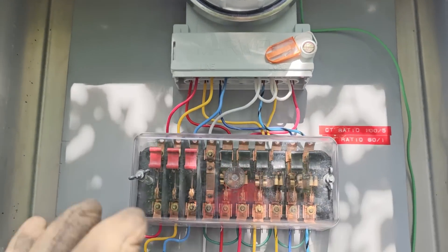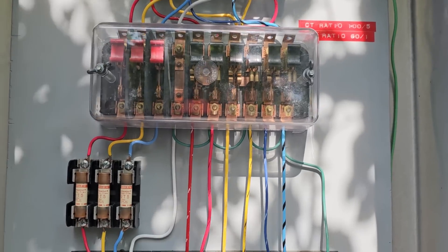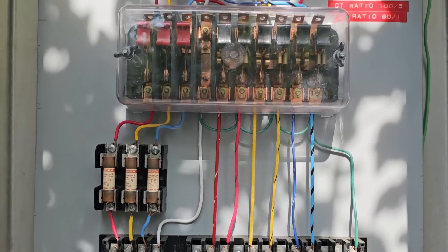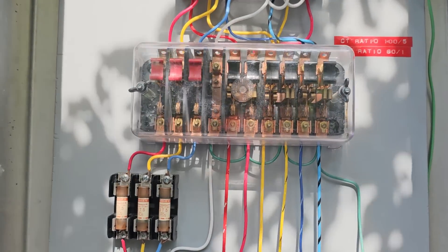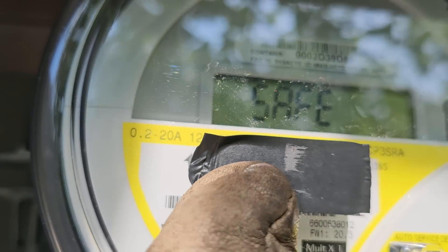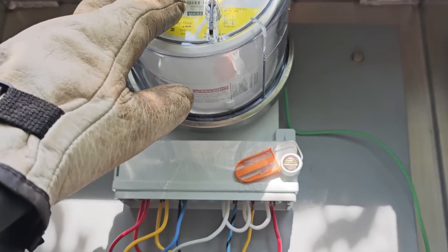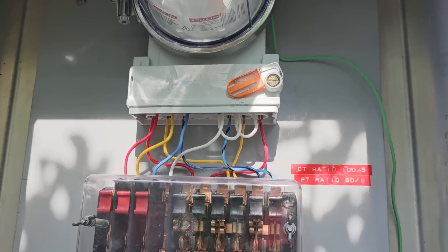This is what the inside of the panel looks like. It's a lineman that wires this up — this equipment is owned by us — and you do need a special metering course to do it, which I have. Sometimes I'll cover our metering guy when he's on summer vacation; inside a building it can take the whole morning to wire everything up. One important thing when changing this meter: make sure the replacement has the same ratings — 20 amp, 120 to 277 volts. The meter currently just says 'safe' on the screen, so we're going to change it out and send it to our metering department for investigation.